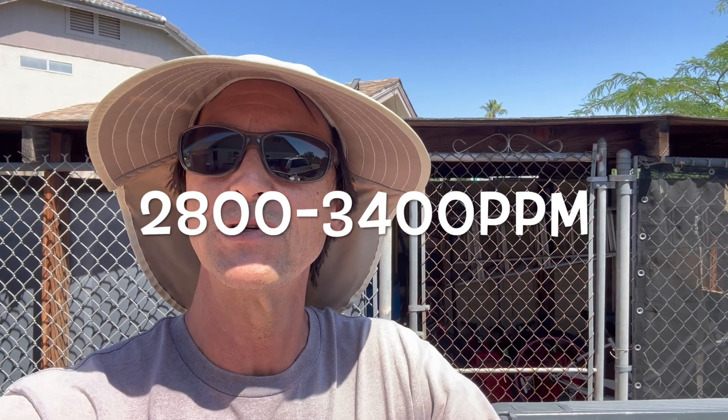A while back I did a video on how to test the salinity of your pool using a particular electronic salt tester, but honestly that tester is kind of obsolete and a little confusing to use. There are basically three — actually four — means to testing the salinity of your pool. I'm going to put links to two different websites in the description that have calculators where you can enter how many gallons your pool is, your current salinity level, and how high you want to get it, and it will tell you how much salt to add. Typically, 2800 to 3400 parts per million is ideal, so getting right in the middle around 3200 parts per million you should be in good shape.